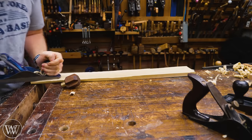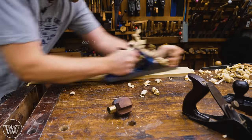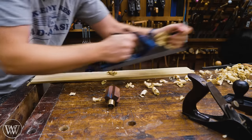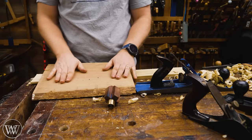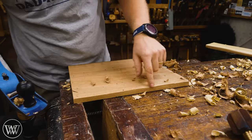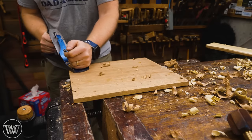The feeling after you sharpen the first time — it just marches right through it. You're getting an almost finish-ready scalloped cut that looks beautiful. With simple woods like poplar and pine, this is a lot of fun. The oak can be a bit of a pain — the harder the wood, the more pain it is. Often with hardwoods, I'm going to do the far corner, clean that up with a bit of a bevel so I don't get so much blowout when I go across. With hardwoods, I tend to do far more traversing.